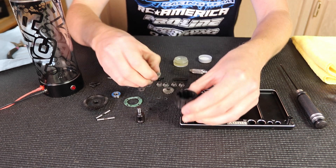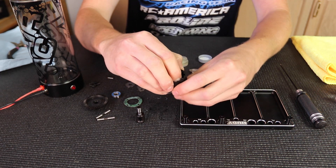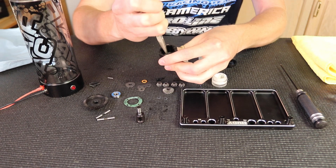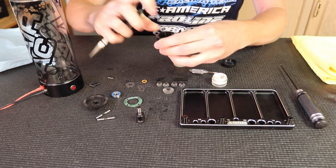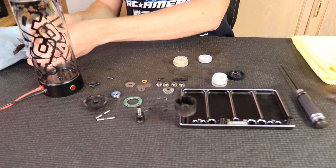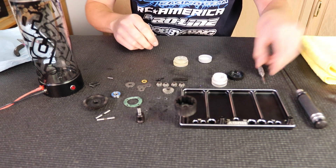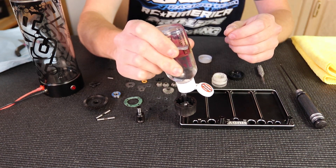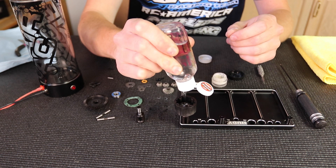Then I'll place the gear in and align it with the pin. You'll feel a click and it'll kind of go down extra. Sometimes you can use pliers to put equal pressure on both sides and it'll click into place. I'm going to put a little bit of diff oil in there about halfway, just so it's underneath the gears and the pins so everything has oil in it.